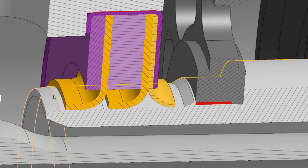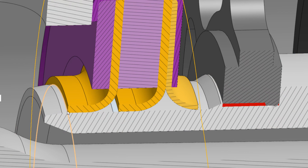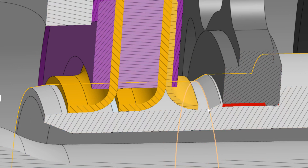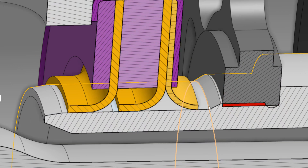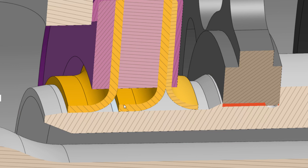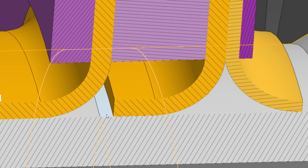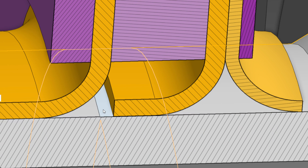With the new seal, we measure that there's only half a millimeter left between this lip edge and the edge over here, and just one millimeter left between the excluder edge and this edge. Also the middle lip unfortunately overlaps with the polished region, meaning that ideally we have to make that polished region a little bit rougher.